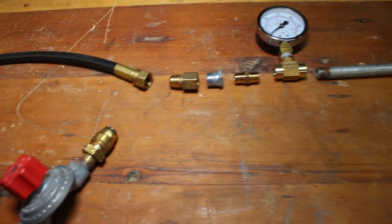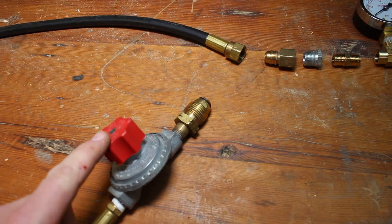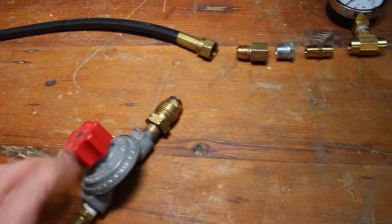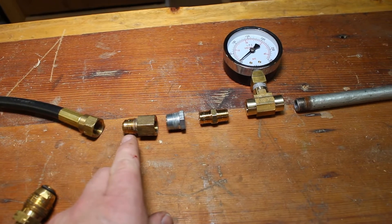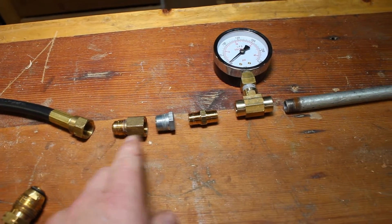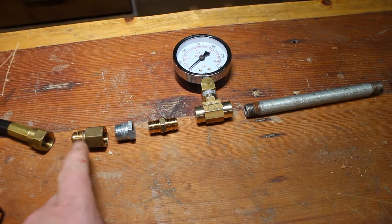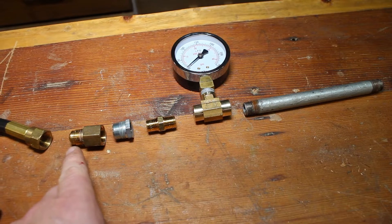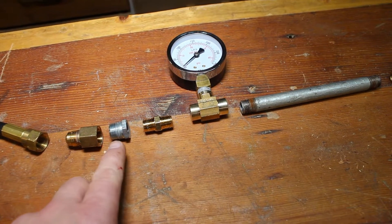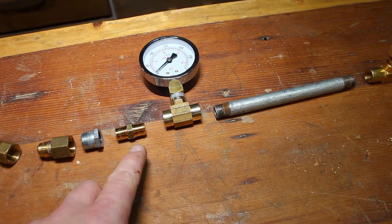Here's everything you're going to need for this burner. You're going to need a high pressure regulator — this one goes up to 20 pounds, or you can get one that goes up to 30 pounds. This hose is a 3/8 flare fitting, and you've got to figure out a way to go from flare fitting to the rest of your piping. I'm going to be reducing it down to quarter inch, using a 3/8 bushing that goes to 3/8 pipe threads, then reducing down to quarter inch pipe threads.